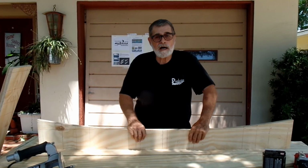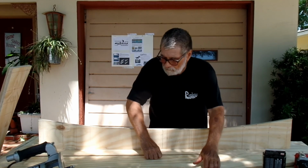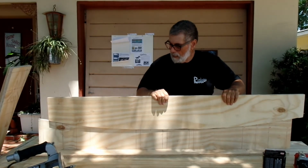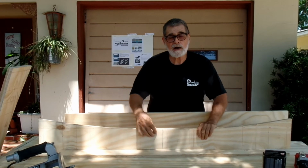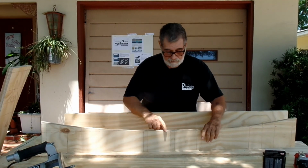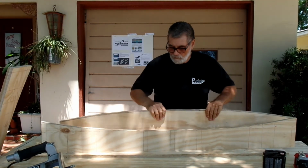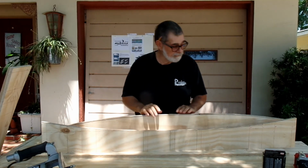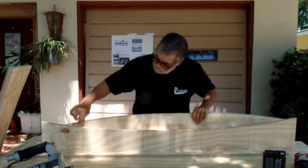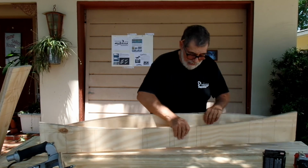Got the bottom and top rockers cut out. The bottom is concave and convex, and the top is concave. Now, the bottom we cut out with the router really smooth, and then we trace that onto the top. But we have a problem now. The top is still just rough cut with the saber saw, so how do we dress that up? Do we bother putting a batten in here and go through the whole process? No, because we already have a wonderful pattern right here.